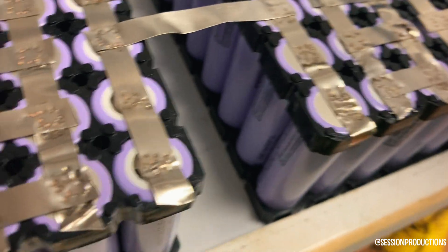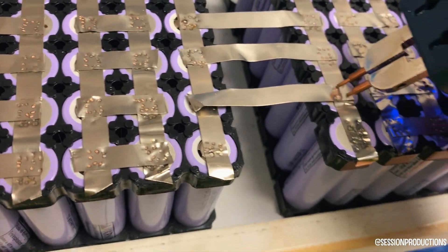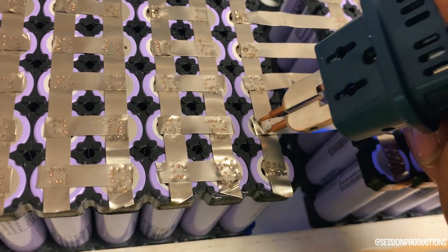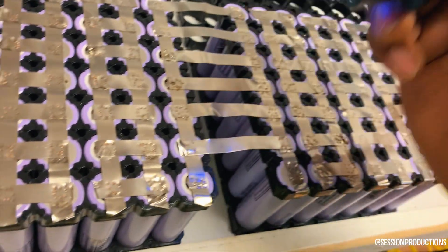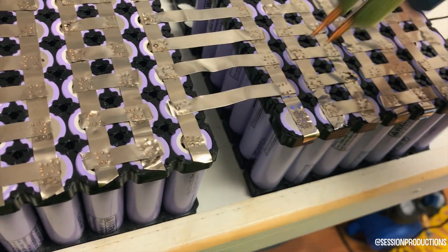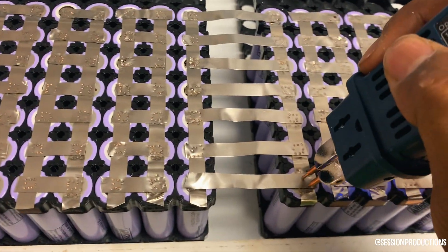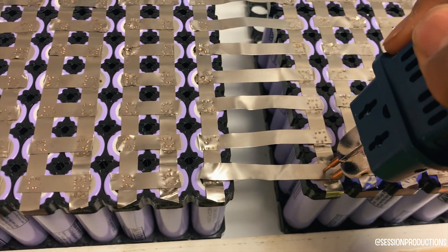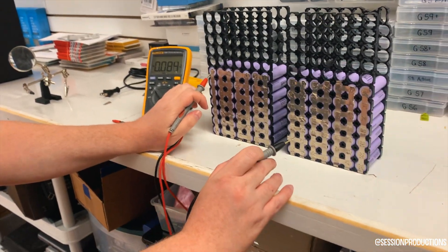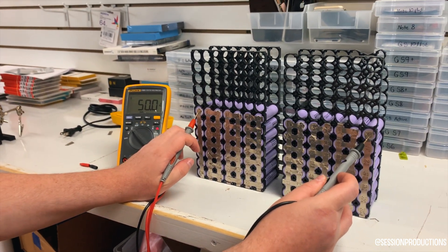Definitely more things are happening now that we have proper tools and proper equipment. Maybe I'll build more batteries — maybe even bigger batteries for bigger projects. You guys should stay tuned for more. I'm almost done with these parallel connections, and as you can see I'm only doing the top set of connections here, not the bottom. When you fold it, it's all in series. That's the main positive and the main negative to give us a total of 50 volts.